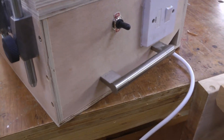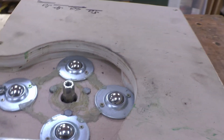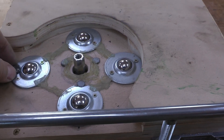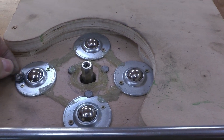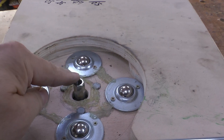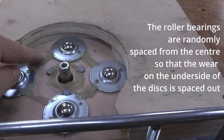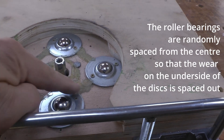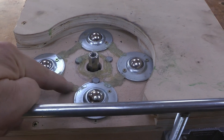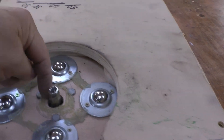I've put two handles on there, one on both sides, just to make it easy to move around. Roller bearings. This is a magnet just to help pick up any metal swarf that comes off. This is the M8 connector coming off the motor. This here is just some hot-melt glue I put round — I did some experiments with using a lubricating liquid, so I thought this would just help keep liquid from getting down onto the motor.